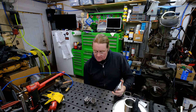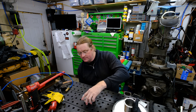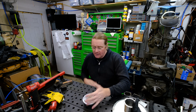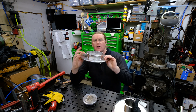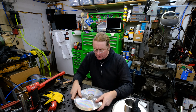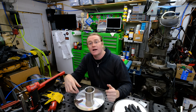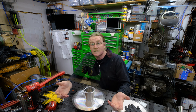I can feed argon from my bottle up through here and purge parts out. I'm going to run this through my table, screw this guy on, connect my argon hose through the table, and now I have argon I can use to back purge through my parts. Since half this part is already done I can just set it on here and now I have argon flowing up through that hole in the center. I can put a purge plug in the top of this and purge it out.